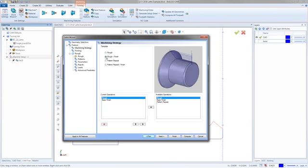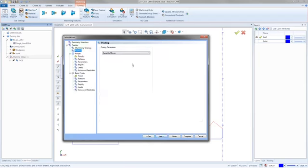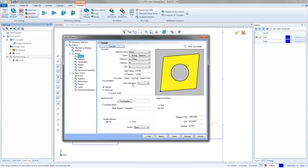I'm going to go ahead and do the rough with the finish here. So I get the rough with the basic finish. We'll be able to use our CNMG for the rough. And then we'll switch to like a VNMG or maybe we'll just use the same tool. We'll figure it out. Next. Posting, you got separate moves, canned cycles once again. Next again. All right, roughing.